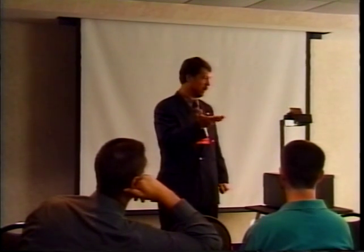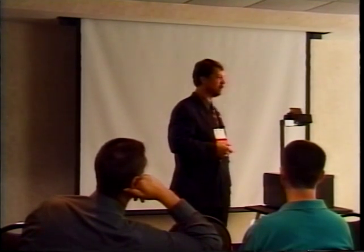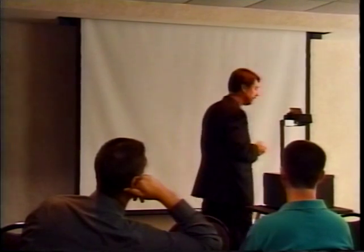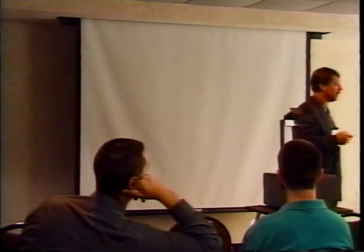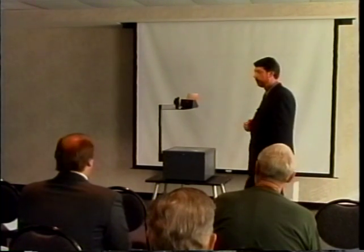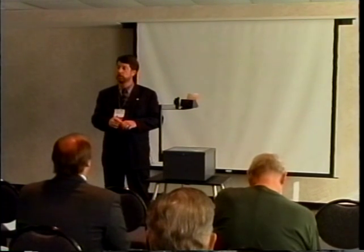And then we want to flip it over into the dial-up position, and we want to compare that to our reading from before. And if your dial positions aren't exactly the same, what can we look for? Pivot and travel. Pivot problems would be one. Cupped hairspring. Roller table hit the shock.